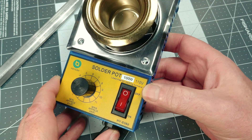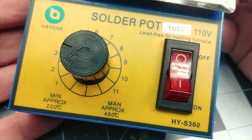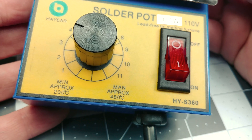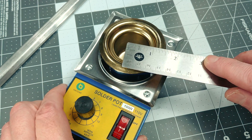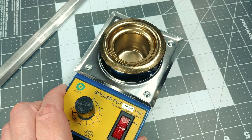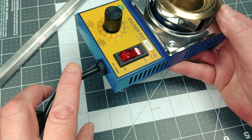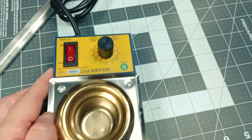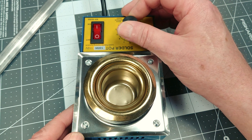There's an add-on 100 watt label attached here — they sell this in several power variations. As you can see, it's also good to know the minimum temperature and the maximum temperature are both clearly marked. This pot design is sold with a smaller and larger diameter pot. This is the smaller diameter at about an inch and a quarter wide, and as I'm going to be using this primarily for tinning wires, this smaller pot made sense. I think I would have preferred the power cord to come out of the back of the unit — less chance of my hand or arm dragging the cord accidentally when it's full of metal — but it'll be easy enough just to turn it around on my bench while using it.